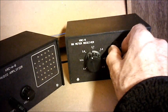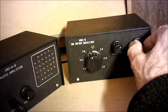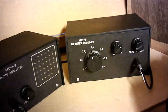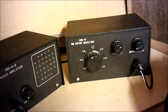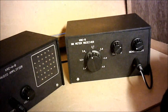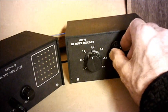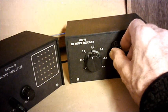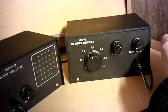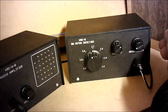We're almost in that landscape around us and we're actually on a hill. It's particularly from about 270 degrees through to about 60 degrees that the land slopes downward, so we get a boost there. The effective height in those directions is actually as if on flat ground, so the antenna appears a lot higher than it would otherwise. Towards the south the land is much flatter, so I don't get so much advantage there, but on the northern side the land slopes away for quite a long distance.